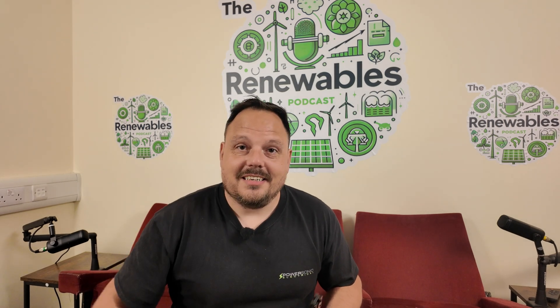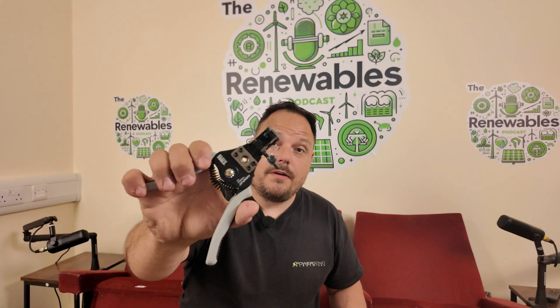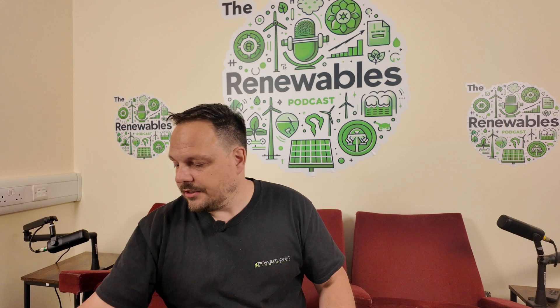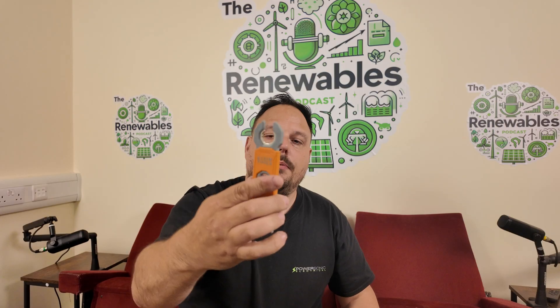You can see when you're up there it's really straightforward to use these — the hardest part is unboxing and filming them. The things I like: the croppers are super sharp and give you a really square cut on the end of your DC cables. The strippers have a set length so you know you're stripping off the right amount of insulation every time without having to eye anything in. The crimper does the all-important work of giving you a tight crimped connection easily — you're not forcing these onto the lugs. They're well ratcheted, nice and straightforward, with rubber handles and metal teeth for a good grip on the back of the body.